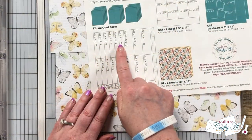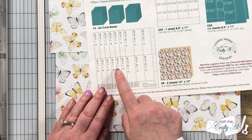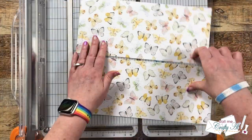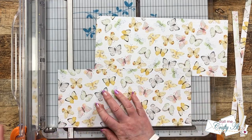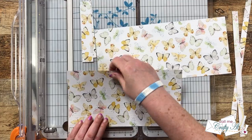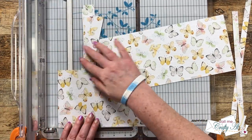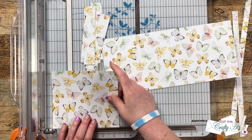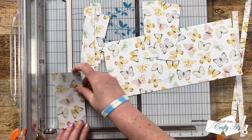Then I'm going to bring back in those five and a quarter inch tall pieces, and we're going to cut those for pieces A, B, and C. I will be cutting six pieces that are one inch wide from this piece, using the one inch mark to the left of my cut line so I can easily push it from right to left. Now once I have those six pieces cut I'm going to stop, because now I need to cut three of my piece C's which are one and three quarters inches wide.